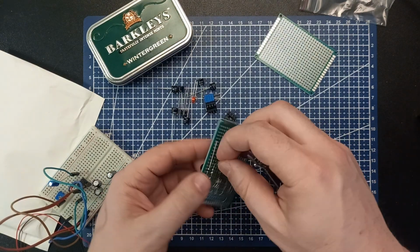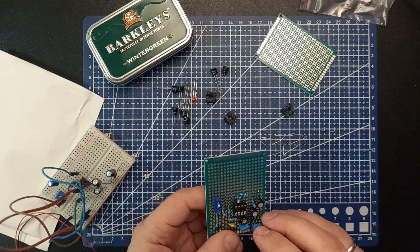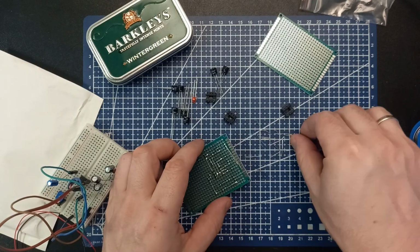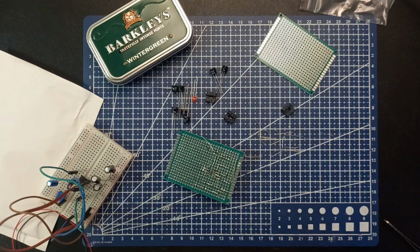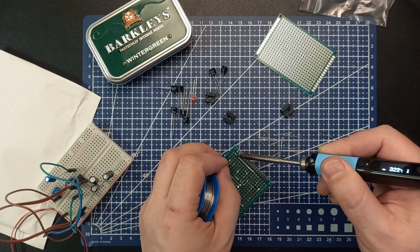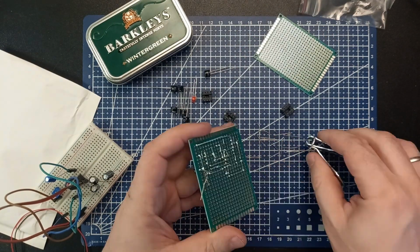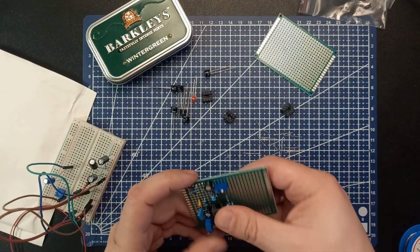The preamplifier is powered by a 9-volt battery, as it should be strapped somewhere on a player. It has no DC adapter socket. Two 3.5 mm sockets, the PCB and a battery nicely fit inside a candy tin box. The main PCB is mounted with double-sided tape. I use stereo sockets to break power from the battery if jacks are not plugged in, to prolong its life.